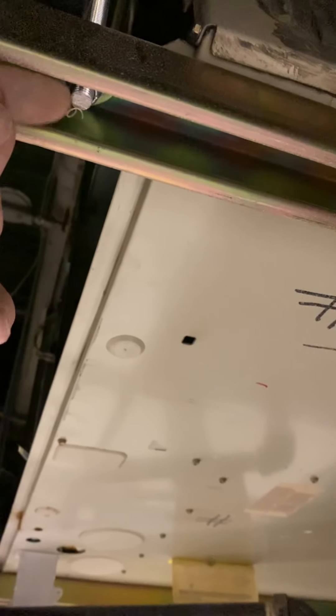When you put this new one in, we need cross braces going this way under our furnace. We're going to put extensions on here — couplings, three-inch couplings — and lower it down an inch and three-quarters so we can get unistrut longways, and then we're going to hang a pan underneath everything when we're done.